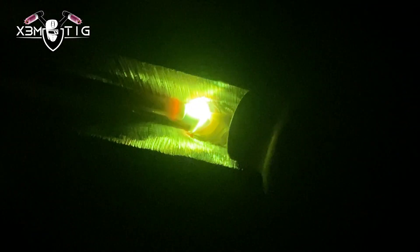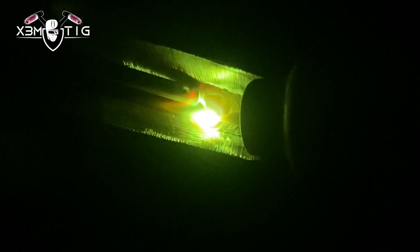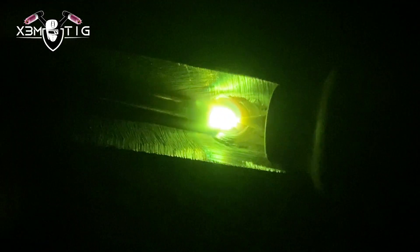This is a really good root for this size of gap. Now I'm going to show you a little tip — this works well always, especially in the field and tight spots. I'm holding at the top, and now I'm going to reposition. I pull the tungsten and torch back, then push forward. So you can reposition if you've got an uncomfortable spot and don't want to stop while welding — just pull the torch and drag it on the weld to reposition. Even if you're stuck with the filler wire you can push it through your fingers and reposition.